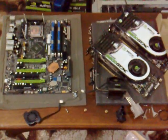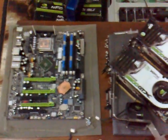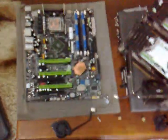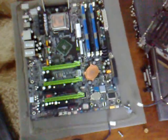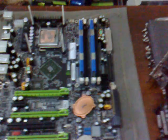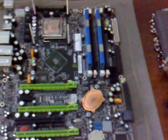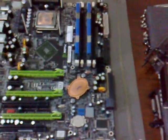Welcome to another inspiring review guys. Today I'm going to be doing a bit of a cooling mod to my 780i SLI motherboard. The reason for this is that the MCP chip is staying really, really hot these days, especially in Sydney because summer's coming. Last night it was at 93 degrees — that is an absolute joke. That's just your boiling point. I'm surprised the motherboard was still running at that temperature.